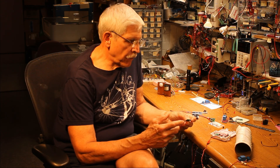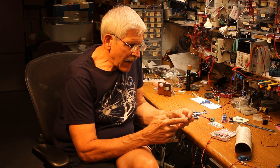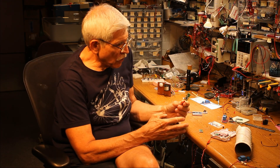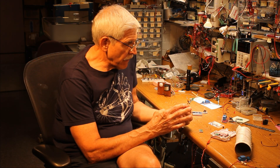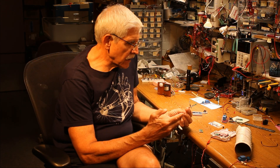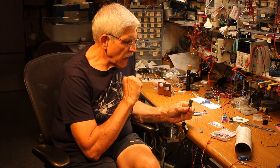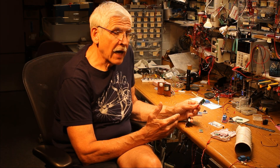The unusual thing about the output pin is this whole device works on 3.3 volts. There's a regulator inside that drops whatever power you give it down to 3.3 volts, so the output is fairly small in terms of voltage — 3.3 rather than the five we'd normally expect. For a simple demonstration, I'm using a cell phone battery that puts out 3.7 volts connected to the voltage-in pin. The LED is connected to ground and its anode is connected to the out pin. If I move my hand, you can see it activates. You can also put this inside a plastic or cardboard box and it will work through the box as well.